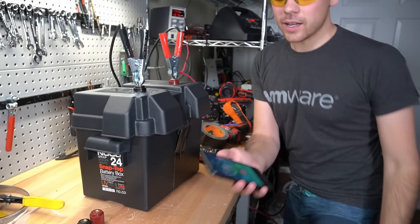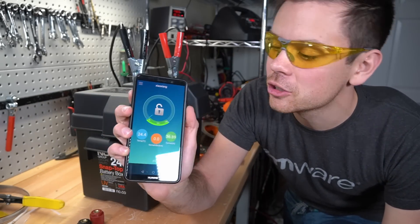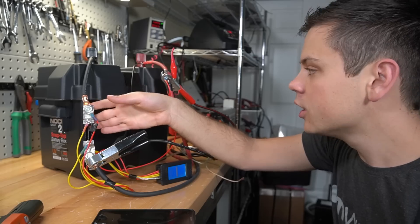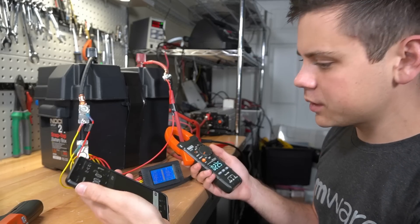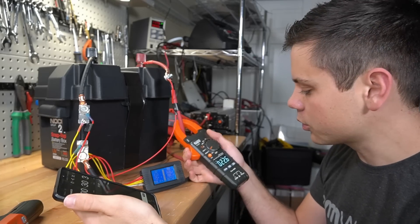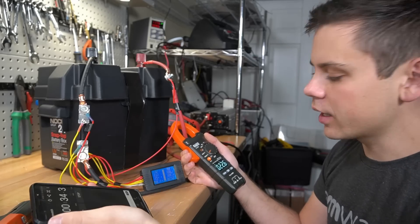The battery is now fully charged and I also added a 300 amp shunt last night. We're going to do a capacity test running at 22 amps at 0.2C discharge rate, and we'll come back in a couple of hours when the test is complete.